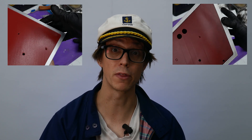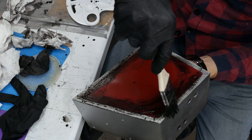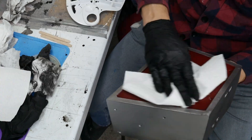This prepared the part for weathering. You want to clear coat the part first, then weather it, let that dry, and then clear coat again. Trust me. For the weathering itself, I used two shades of oil-based paint — one was black, and one was a burnt umber color. Basically, this is a trust-the-process type of thing. You're just going to take your paint, brush it all over the surface and really jam it into those crevices, and then wipe it off with some paper towel. When you're ready to do your final wipe down, I'd suggest getting a clean piece of paper towel to finish it off. You can repeat this process with as many different colors as you want to really get that aged metal look.